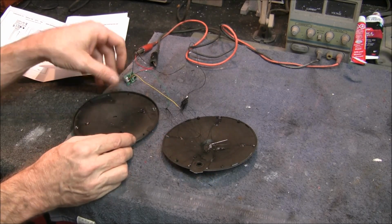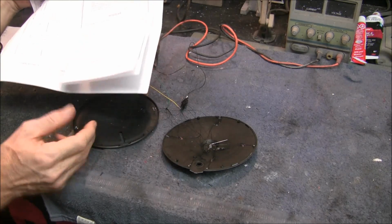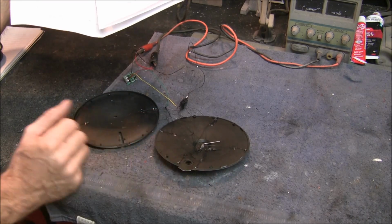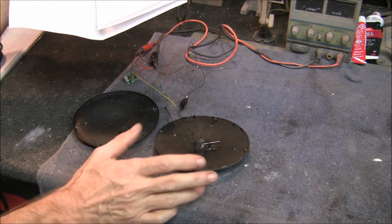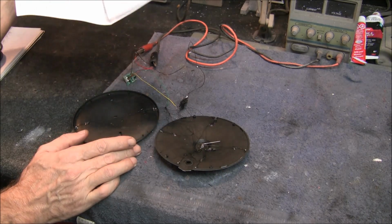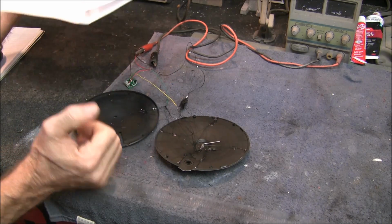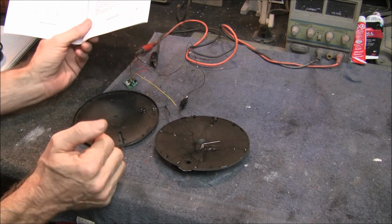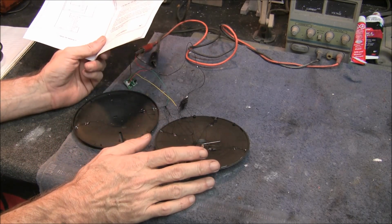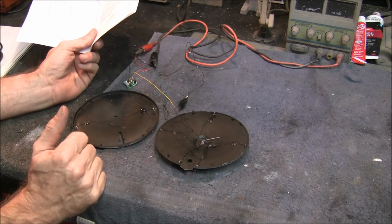But then on our navigation side, we have the green wire, as you can see here, which connects to all of the negative sides of all these SMDs. We have 8 of them in total: 5 on the top and 3 on the bottom of our saucer. So all 8 of the negatives of those are connected to the green wire here. And actually, the negative side of the strobe light on the top is connected to the yellow, so we've got those 2 separated out.